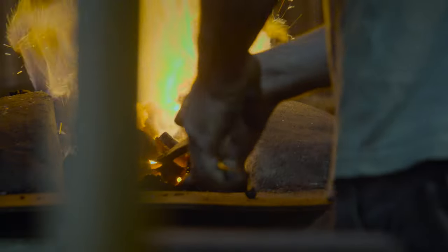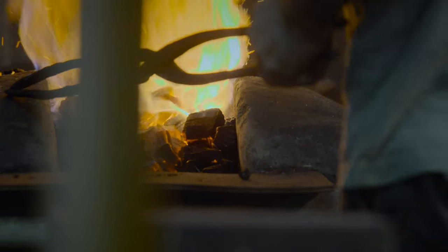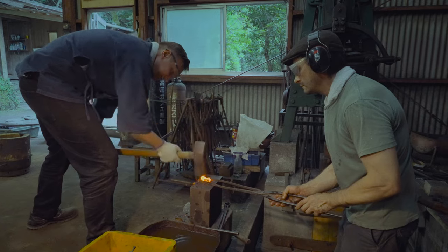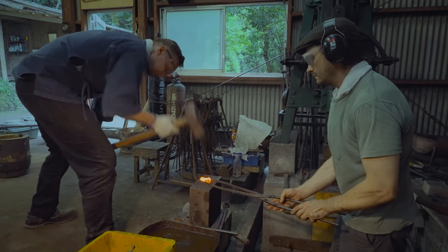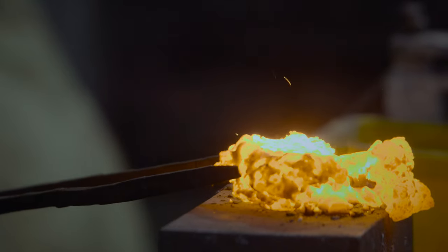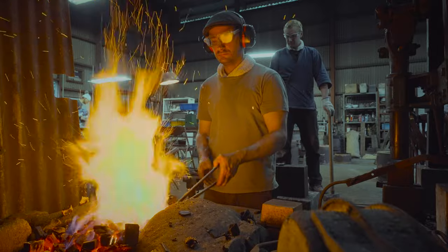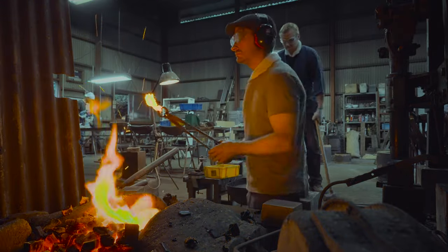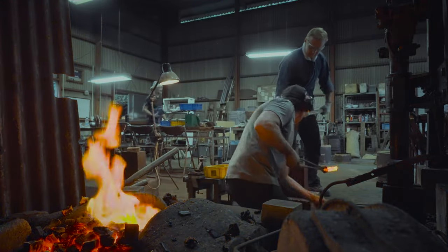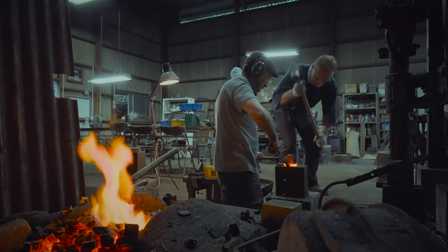And so after this, the next step is a very difficult point. It's the forge welding. But they work very well, so we can successfully finish. Normally, when we try nine times folding, we lose more than 50%. But this time, we can get maybe 55%, more than 50%, from about 4 kilo or 5 kilo, 3.5 kilo. We successfully finished too.